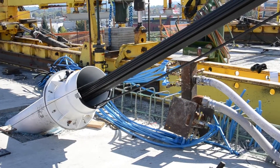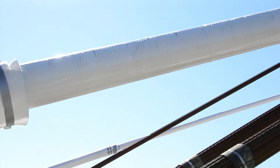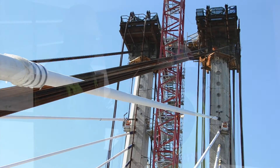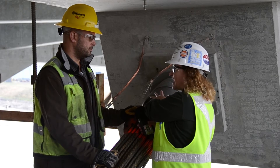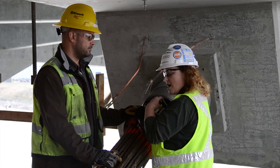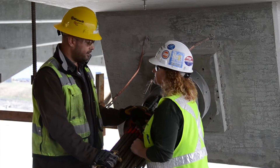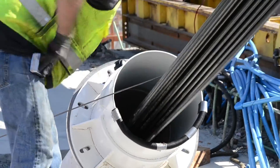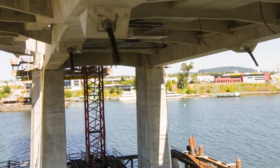Last episode we talked a little bit about the strand installation process — going through the saddle, the HDPE pipe, etc. So tell us what happens once the strand is fed into the anchor block underneath the bridge. How is each individual strand stressed? The strand is fed through the anchor block here in front of us through one of these individual holes, and a monostrand ram or jack — a hydraulic jack — is used to stress individual strands one at a time.